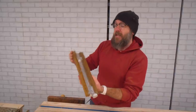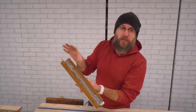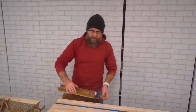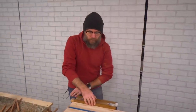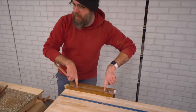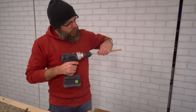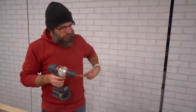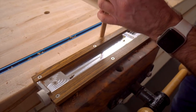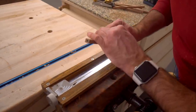This is the jig that Andrew invented. It's pretty darn slick. This is just a prototype, so the production model might have a couple of different parts on there as we learned what works and what doesn't work, but this fits into your vice like this. Then you can take your pencil blanks and put them between these two centers here. I've got a little bit of glue in the ends, so I'm just going to drill that out. This end has a tooth here that's going to bite into the wood — you just want to make sure it doesn't bite into the seam, so you want to rotate the pencil so it doesn't do that.